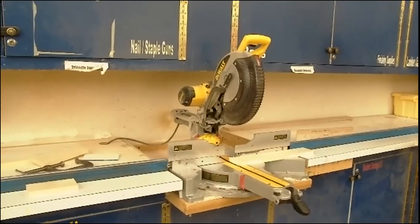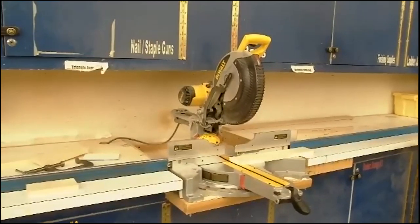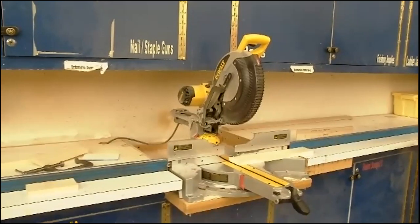So you'll get comfortable with that very quickly by listening to the machine, and by the amount of pressure it takes to push a board through a machine. Those are things that with a very short amount of experience, you'll be able to control very easily. The point is we use all our senses in here: our sense of hearing, our sense of touch, and we very much use our sense of smell. We can tell if we're pushing a board through the table saw too fast or too slow. If the board starts to burn, you're going to smell it. On the band saws, you can smell if you're pushing too hard or too slow. So all of our senses are necessary here. This is one of the reasons we don't wear earbuds and things like that in here.